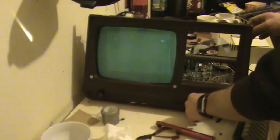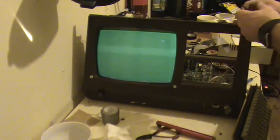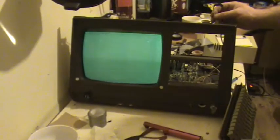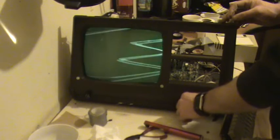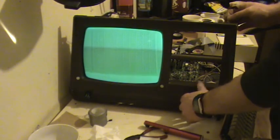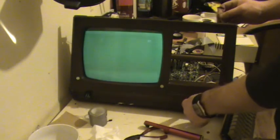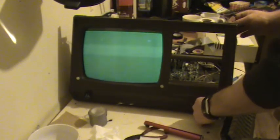But I think I've worked out what its main purpose was anyhow for these 2 video inputs, like I said. Start off with the motherboard's normal output, which is this. Activate the Videx card 80 column display and then flick it over to the Videx, because that's what that is. This switches 2 separate inputs for the one output to the analog board, so that's your on off switch.